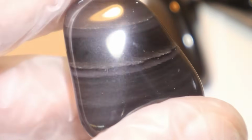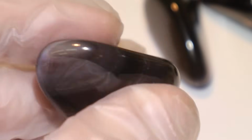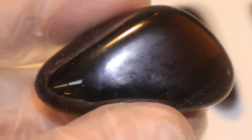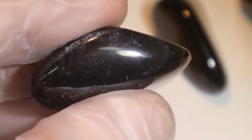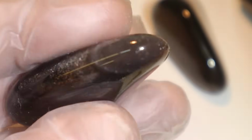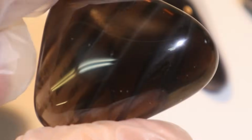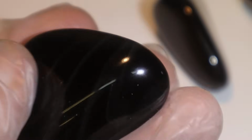It would be way easier in a vibratory, but I was told by so many people that it is impossible in a rotary. It clearly is not, and it actually was not that difficult once I was on the right track. So once more, thank you so much to the people at the Rock Shed for giving me the secret tip of use more ceramic media. Not plastic, use more ceramic. Literally the instant we added ceramic media, it was night and day.